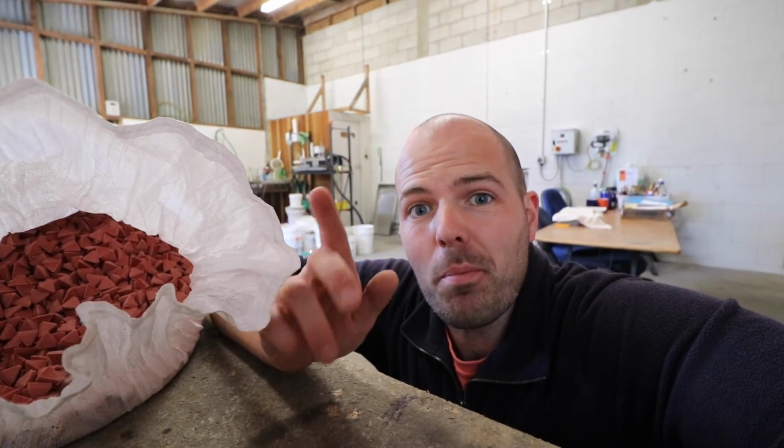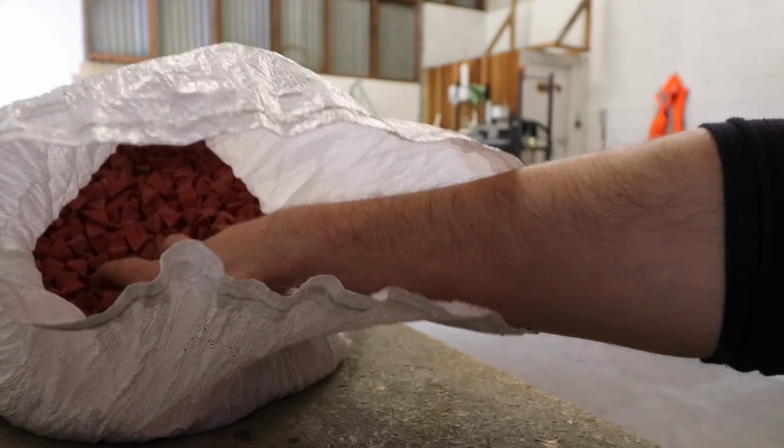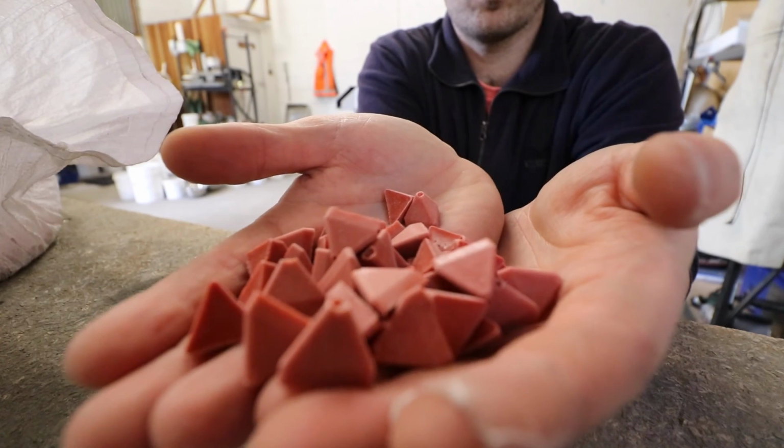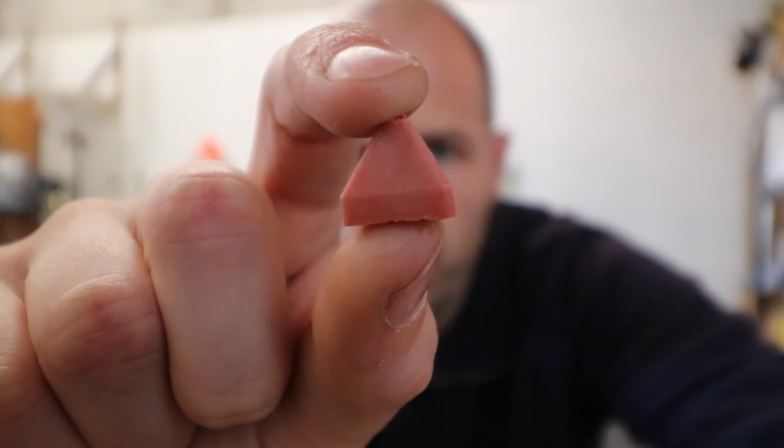Damn, these things are big. Now I knew that, I think this should work. These are called plastic pyramids. What these do is take the titanium that we've tumbled already in the rough cut, in the ceramic, and give them a sort of a smoother, nicer finish, you know, just a more of a satin feel to them.